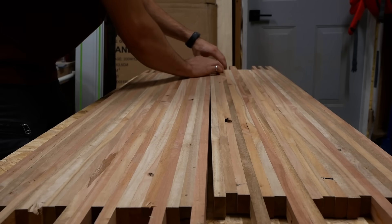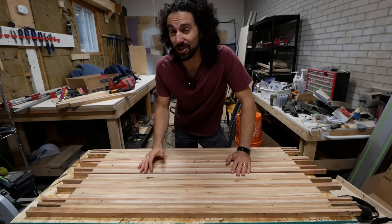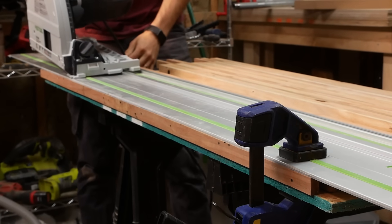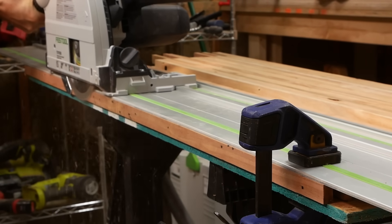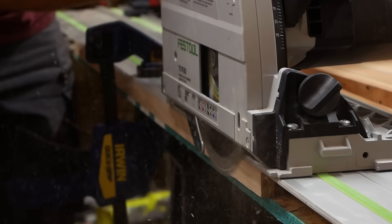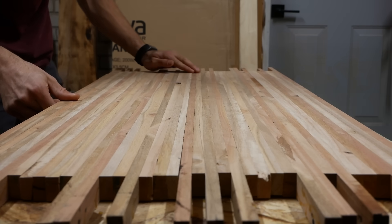The best thing to do would be sending each mating face through a jointer, but I don't have one. I could use my jointing jig for the table saw, but I want to be a little more precise here, so I'm going to step outside of the beginner tools universe and use my track saw to joint these faces. Track saws aren't cheap — especially this Festool one — but they are such a game changer. They allow you to do jointing cuts, cut straight things at angles, and cut down big pieces of plywood way safer than on a little job-site table saw. I'll have a link in the description. Here are the two edges I ran through the track saw — boom, perfect mating faces ready for glue-up.